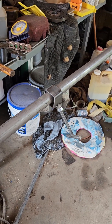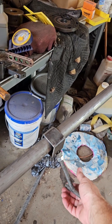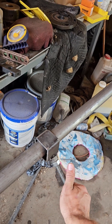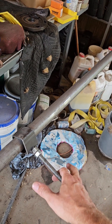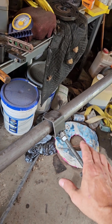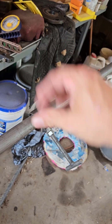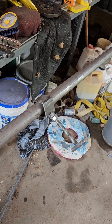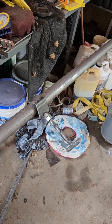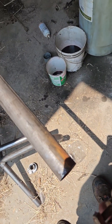But this does work for something like an A-pillar bar. If you put a 45-degree bend in it, leave that clamped, loosen your tube, slide it forward to the next bend, and then you can turn it — say 25 degrees — you're turning the tube, not the clamp. That puts your 25 degrees on the second plane for your second bend.